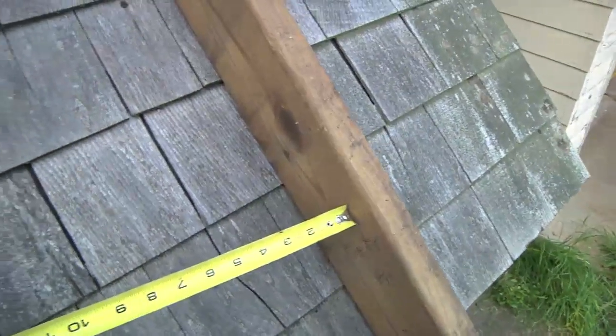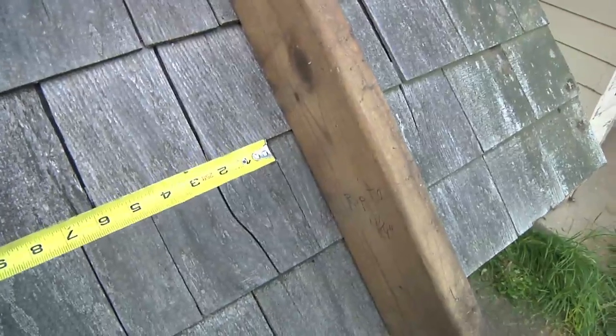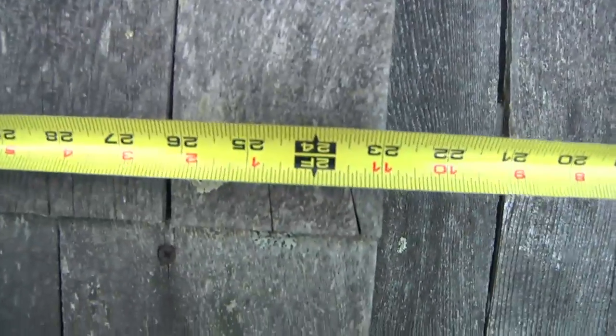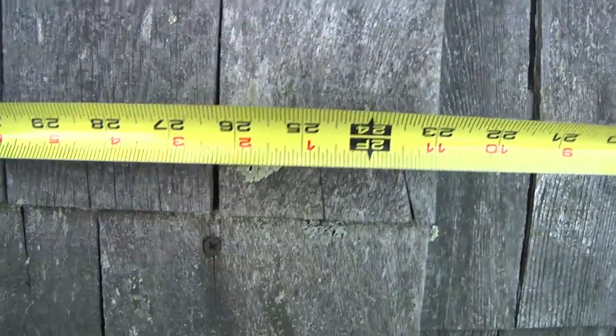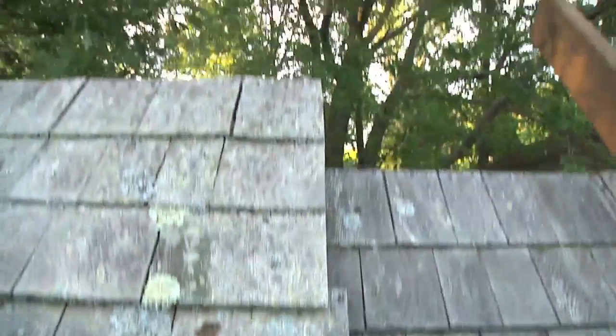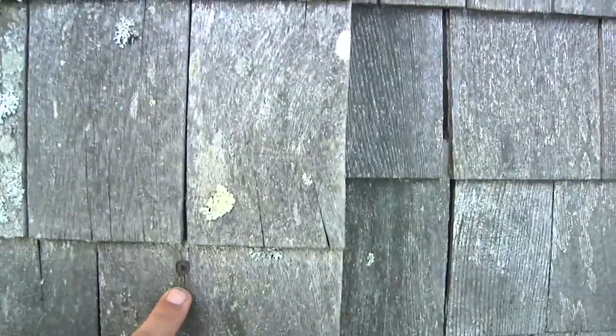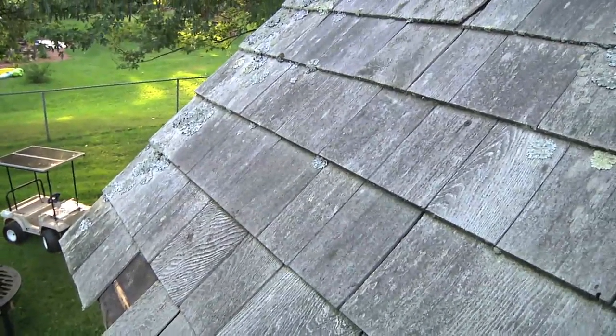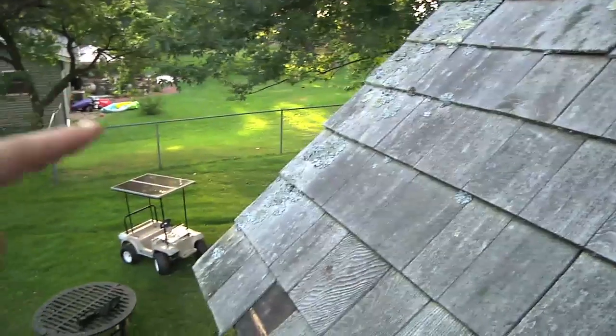Up here on the roof you can see it's really two roofs — you can even look between them. I measured the aluminum brackets on the solar panel; they're basically 27 inches on center. So measuring from one side over 27 inches, there's a screw there because there's a support that runs up to the ridge underneath. I want that to be the center of the solar panel, then 27 inches over to support the right half. The other end will sit right down here, and I'll add some additional blocking under the roof to support it.